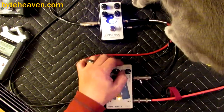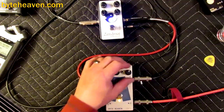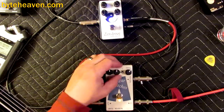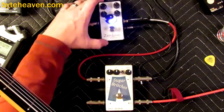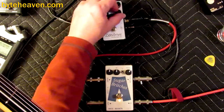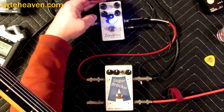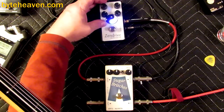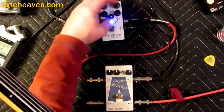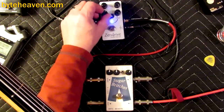The Zen Drive pedal is an inverting pedal — worked that out pretty quickly. The Zen Drive is a pretty good pedal; it sort of walks that line between distortion and overdrive because it has a pre-emphasis defeat knob called Voice. You can dial in some heavy drive, and you've got your tone which is the post-overdrive tone cut.